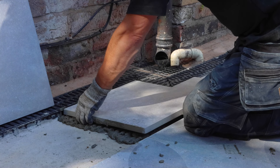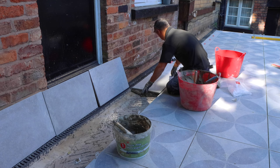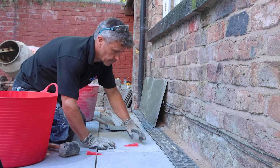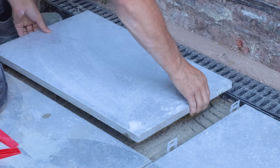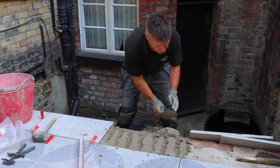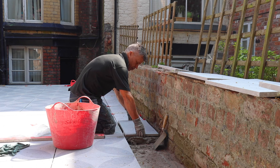On the second half of the patio — installed with Rock Tight mortar — I stockpile the cuts, mix up the Rock Tight mortar, lay it down, and install the cuts the same way as the main slabs. That's my last cut slab now getting fixed into position to complete one side of the patio. I then did the same on the top and opposite side until I'd completely installed all the pre-cut tiles.